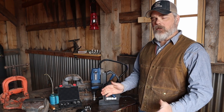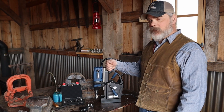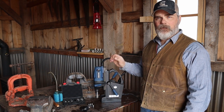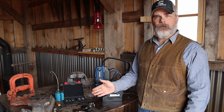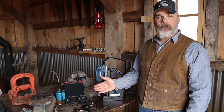If you're cutting through quarter inch steel doing a project or building something, this thing is going to work just fine. The electromagnet is plenty strong to mount sideways on a truck frame to drill new holes, or anything like that. I am impressed with this tool. The dovetail slides are all machined aluminum, which is a very nice feature. The cutters are very sharp and they work great. I just used cutting oil and some spray tap. They do have that coolant reservoir that mounts to the machine, which would be a great option as well.